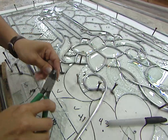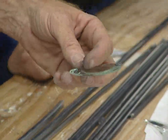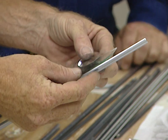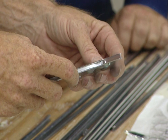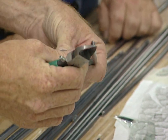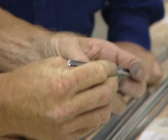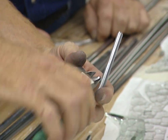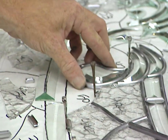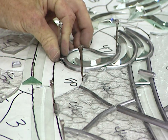After every piece of glass has been cut and beveled, it's time to start building the window. This will take approximately eight hours depending upon the size of the pattern. The glass is wrapped in a metal caming that's in the shape of an H on the end, and it's simply bent to fit the shape of the glass and wrapped to hold it securely. In the old days, it used to be 100% lead. Today, they make it out of much safer metal alloys that are soft and keep the hazard down. Then it fits into the window and is held in place by a temporary stay until we're ready to solder the window.